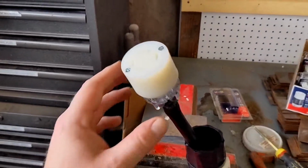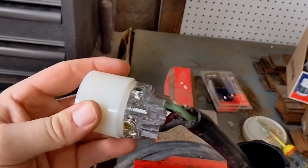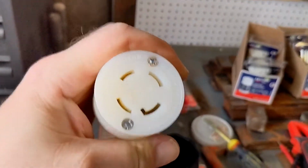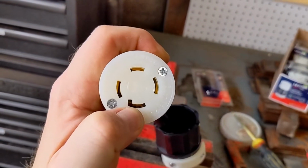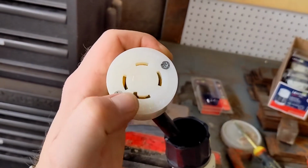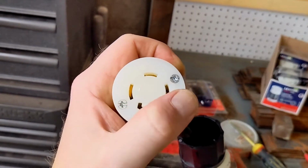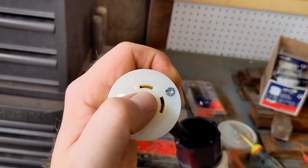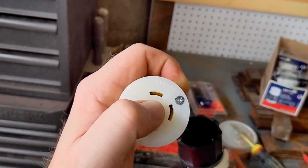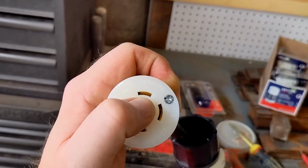We have our new female plug installed, and I just wanted to quickly go over. Green, of course, is ground, and then I always go straight across the plug. This would be our ground. Then I come over here. This is our 220 lead because we are low voltage three phase, and then this is our 110 lead, 110 lead. And then I always correspond directly across from the ground the 220 lead, of course, and I always correspond that with the color red.